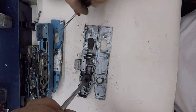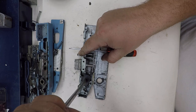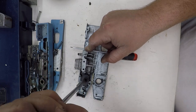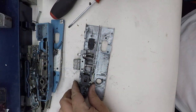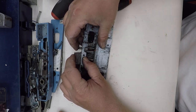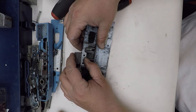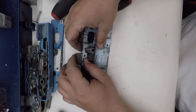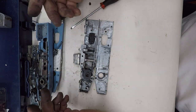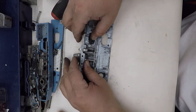Assuming that this part here would be holding it straight, it should be sliding a little bit better than that. It does work — very crusty, but not very well. This is your secondary: when this one is pushed in, this one becomes solid. But we're not getting any action there either. Normally when this one's pushed in, you can't push the other one in — but we can. So our secondary's not working, which is obviously not very good because if the secondary's pushed in and you can still pull the latch back, you can get a screwdriver or a key card and basically shim the lock open.